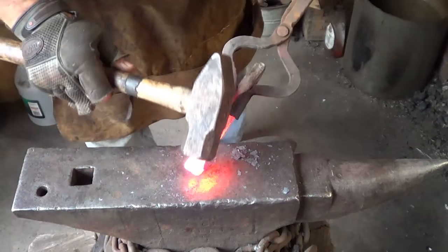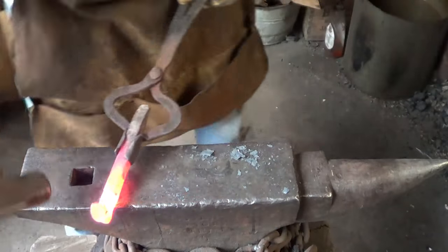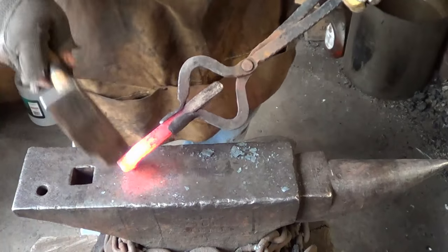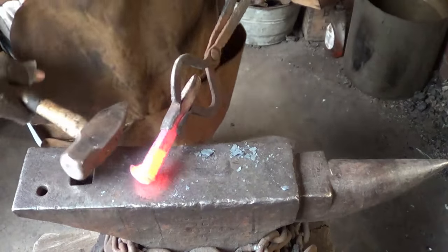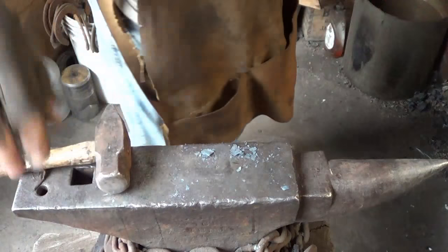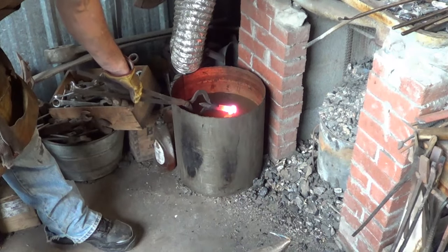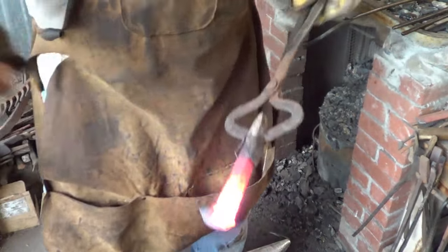The thing about the spike is that this is a really disrupted kind of shape quite often. So I want to make sure that in the process of making that nose I don't do a whole lot of rolling, otherwise you end up losing the mouth. We're okay for now. Next step is going to be to heat this thing back up and then drop that nose out a little, so that I don't just deform the steel that I'm going to use for the horns. I quench them a little bit just to harden them up - we're really after just that nose part.